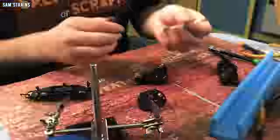Let's put the front of the motor back on. Let's get this thing reconnected. There we are, so we've got power to it. Now let's put those brushes back into position. There goes one, and there goes the second one. That first one has actually worn a little bit unevenly. If I had some time, I would probably try and fix that,